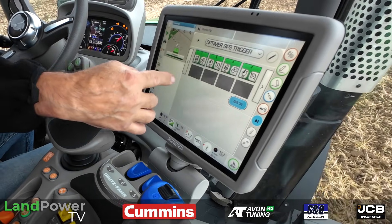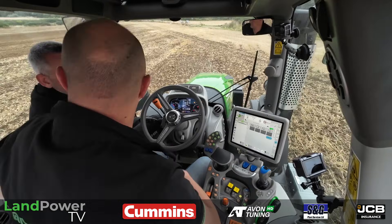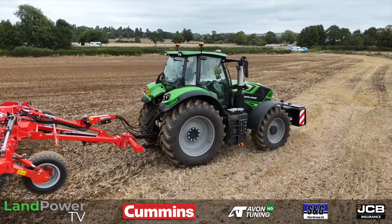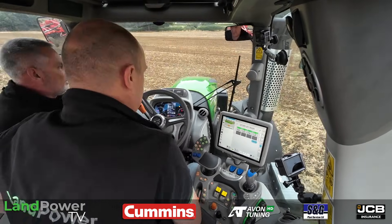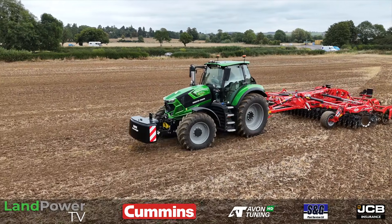Let me just bring this screen over here. This is our headland management - this is a process you can see is going to happen. Next time it will do this first function, which is the GPS out of work, and that's going to lift the machine up and stop the cruise control. And then because we've got headland turning automatically set, it's going to take the next trigger which is the GPS into work, and then it's going to lower the machine and reset the cruise control. We've had a very simple setup - there are four steps to this one. But you can make them as large or as small as you wish. To set all this headland management, you can do that sat still, static. Yeah, it's all programmed - we can change it and modify it.